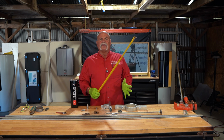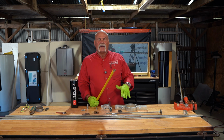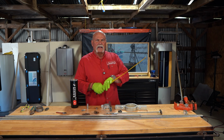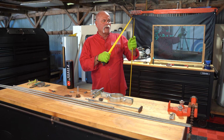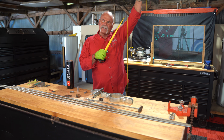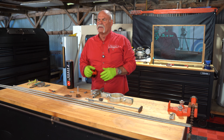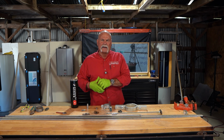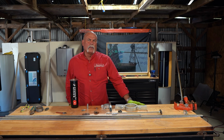There's a lot of different ways to do it. And literally, if you've just got a floor elevation and you're pulling everything off the floor, it's just inverted. You would literally come up and say, okay, if I want to go up to 8 feet and add 3 inches, now you can measure from the ceiling and know your difference. There's a lot of different ways to do anchors. Figuring it out on paper in advance is always a great way to start.